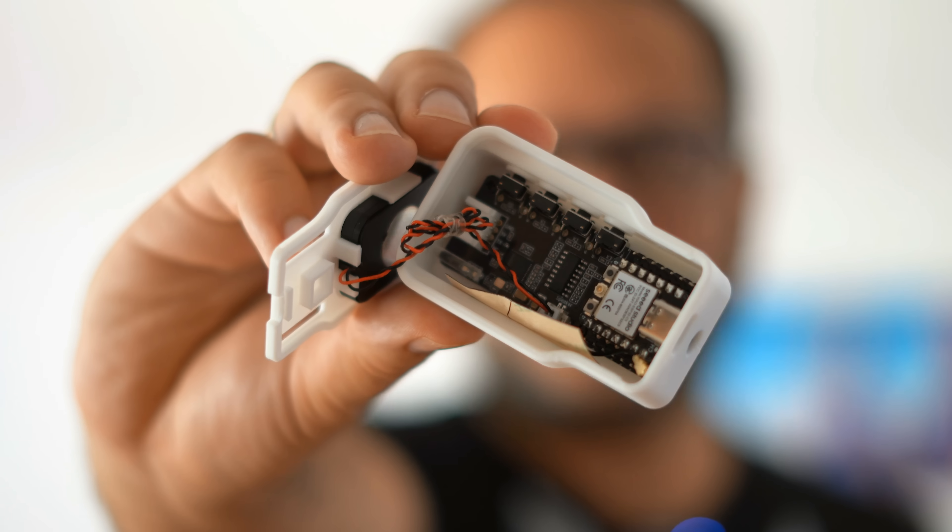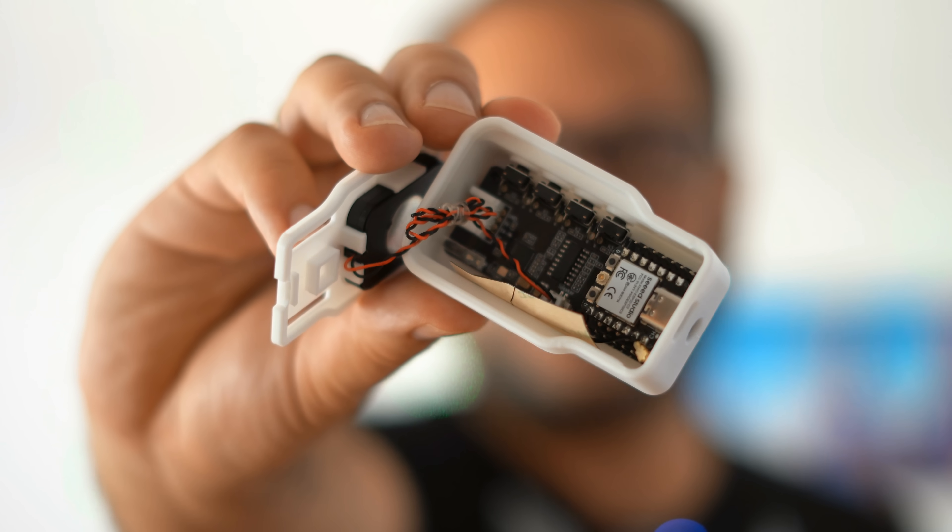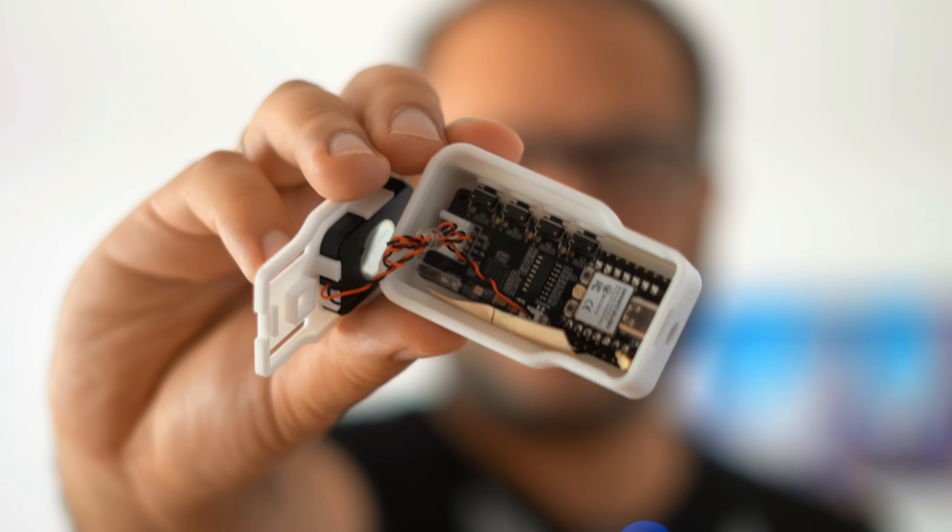And that's it for today — the Seeed Studio Synthesizer. Summing up all the components in this small box, I think it's roughly worth the asking price. I have to say, though, that selling this as a MIDI synthesizer doesn't quite nail it, because to truly call this a synthesizer, I would have expected a working USB MIDI port right out of the box. To pull that off, a slightly more capable microcontroller instead of the ESP32 would have been necessary. I'd like to see the manufacturer release a version 2 that's just plug-and-play for hobby musicians.